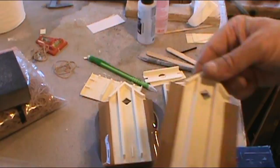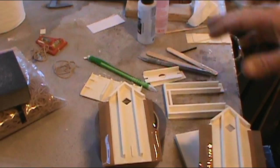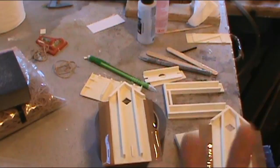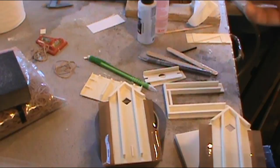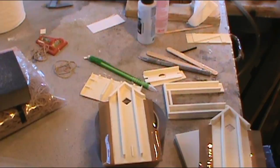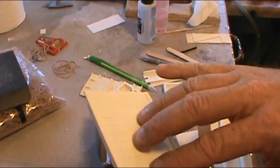You can use a couple of different paints. I use Testors primer — the kind you get for model airplanes and cars. There are also Krylon primers you can use. I generally tend to go for the gray primers. You shoot very light coats of primer on there — one or two coats — just make sure you get good coverage, then let it set up and dry. Resin is a slick surface; I use baby powder or cornstarch in the mold which gives it a slightly rougher surface, but resin itself is still slick, so give it a couple of light coats.